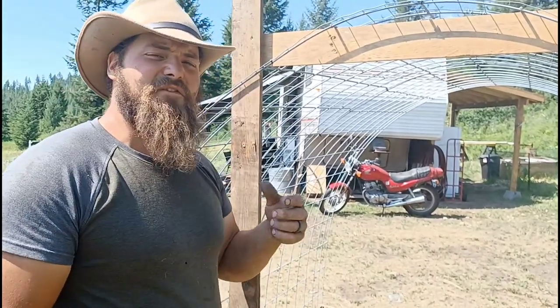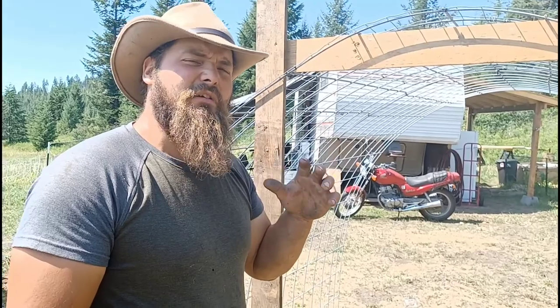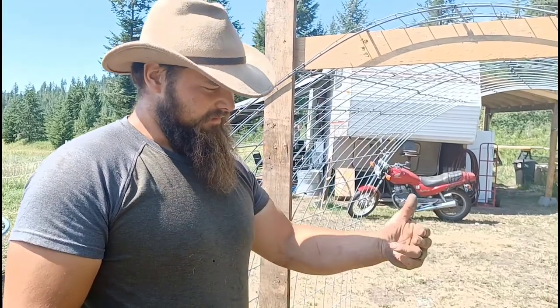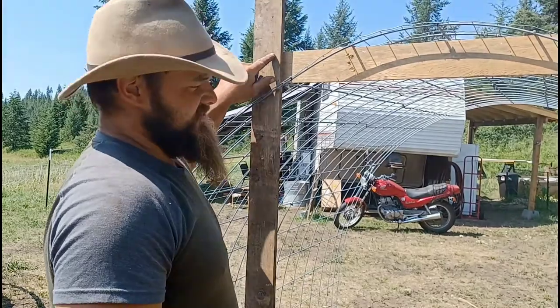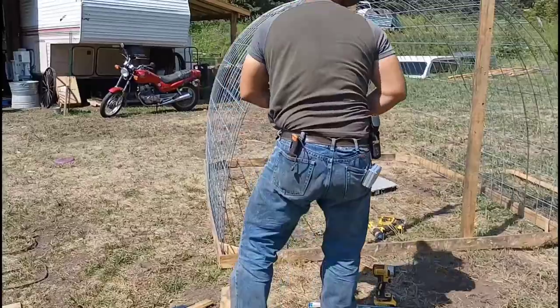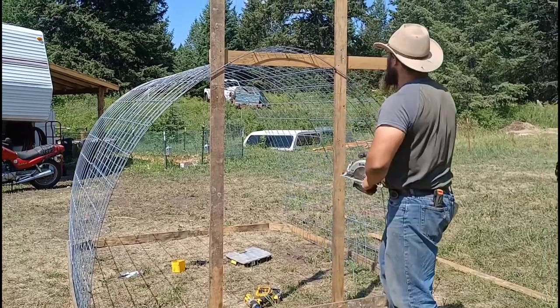But the other thing is if you make a mistake, the reason I'm using screws is it's a lot easier to repair what you've done wrong. And if you bury the head, sometimes they get in there so far it's hard to get them back out, or they won't grab the wood properly to back out. So it's always good to leave your screws just flush and not bury them. I still have a bad habit and sometimes I bury them, but I'm trying to work on that. It's always good to wear the appropriate safety gear when doing this.